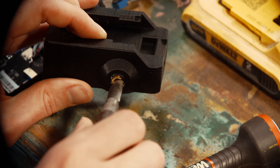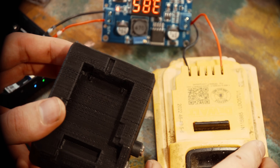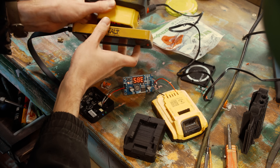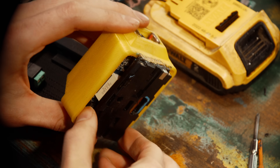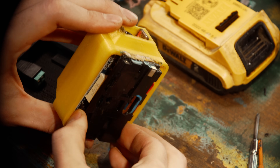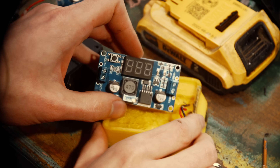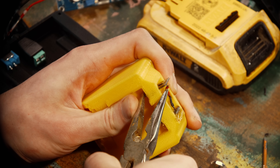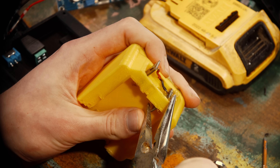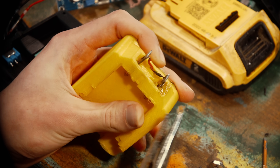My old designs didn't have a power switch, but I'm adding it because the battery being constantly connected to the voltage step-down unit slowly drains it. So adding a switch right here allows me to not drain these batteries without having to unplug them. This guy gets a little washer and a nut so it can be secured in place. Then I'm going to harvest some parts off the first iteration of the battery adapter I made for my camera because I'm out of threaded inserts right now. My print quality on this one was very mediocre — it was a proof of concept more than anything. That's why I'm making a new one. I'm making these videos so fast, I'm learning a lot about how I use these things and in what ways I can make efficiency improvements to my gear.